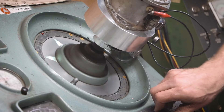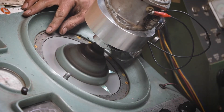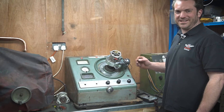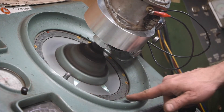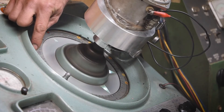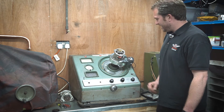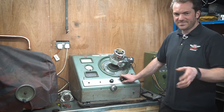I've got it pretty much exactly right straight away. Here we can see we're on the six, there on the zero, there on the six, there on the six, there on 180 degrees, and on the six there. So they're 60 degrees apart — obviously it's 360 divided by six.